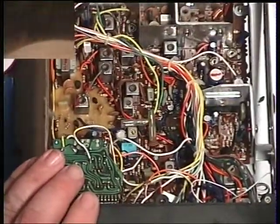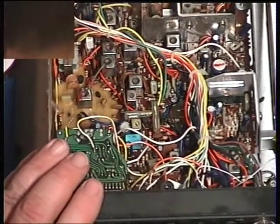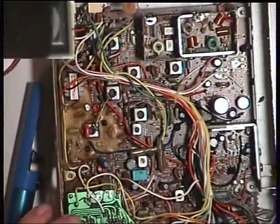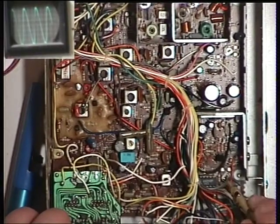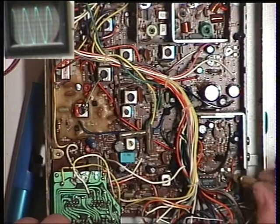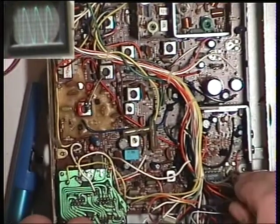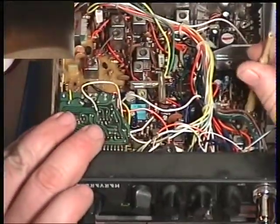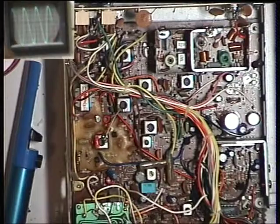I need to have S9 at 100 microvolts - it's just slightly lower, reading S8. The receiver adjustment on these radios for the receive meter is the preset just next to the AN240 IF subsystem chip - and that is for the receive meter. So we'll adjust that slightly. It's not far out, but it's far enough out for me to adjust. We'll bring that up to S9, otherwise the customer will say it's got a lazy needle. There we go - that's done.